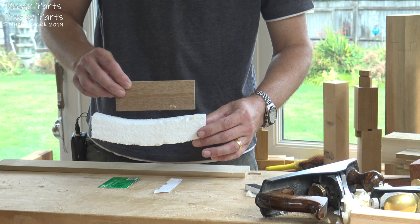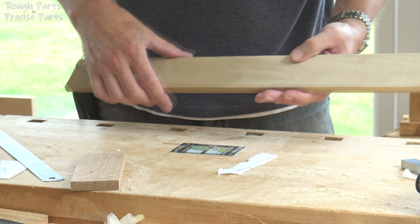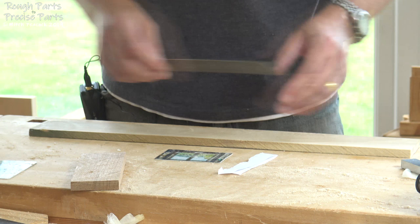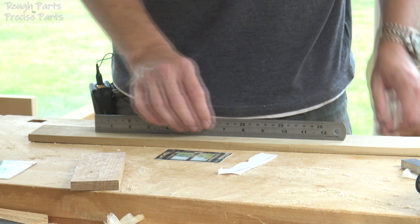Let's look at our sawn board. We've got the rough sawn on one edge, rough sawn on one face, and then the planed sides that were prepared on the larger donor piece. Taking a look at that with a straight edge, you can see that the ruler pivots quite easily on this face — so that's obviously convex. On the sawn side it doesn't rotate in the middle, it rotates at the ends, so clearly that has a concave surface — we can slip almost a credit card under there.